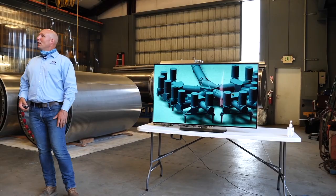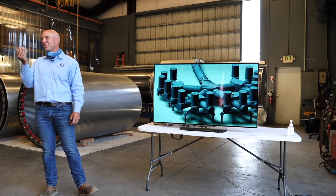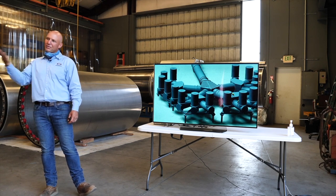But did you have to replace that coating? We haven't yet. Time will tell. Everything looked really good, but anti-fouling coating by nature is either sloughing off or degrading over time. So you would think any kind of anti-fouling coating wouldn't be an indefinite solution. It's going to become less effective over time. Sometimes you get a calcium buildup on a coating, and then other stuff can grow on top of that.